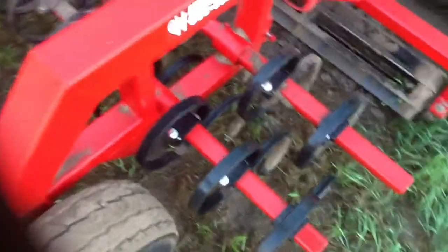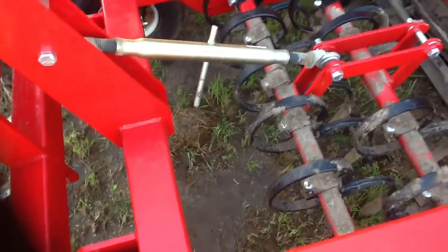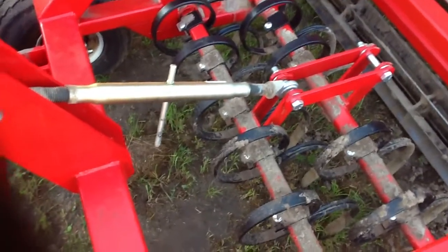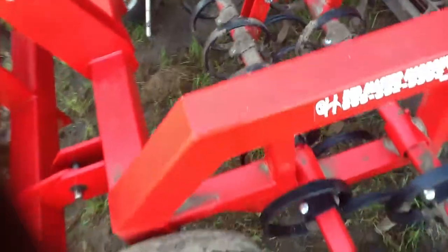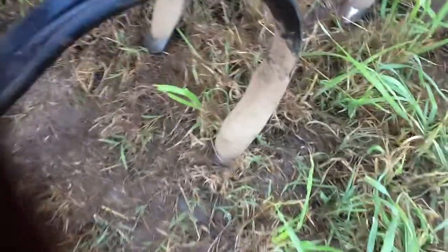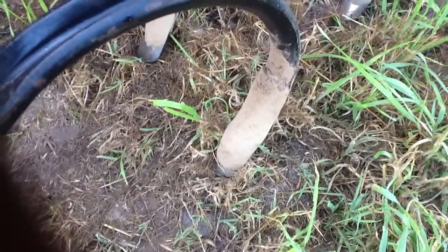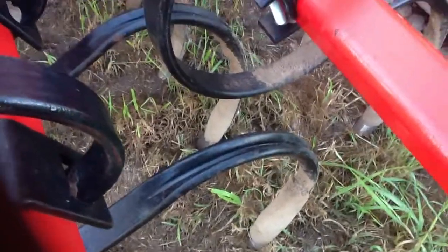As we go back a little farther, we go into the two rows of S-tines, controlled by a top-link bar. Usually during travel — loading on or off a trailer — I will pull it all the way forward to get those tines up off the ground as much as possible so they don't dig into my trailer. The S-tines have the same hardened face tips as the ripper shanks we saw a minute ago. They also have the double head tips on them, which I've also flipped over on this particular unit, so even those do a little bit of breaking and busting as they roll through.